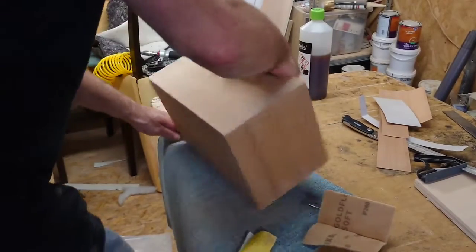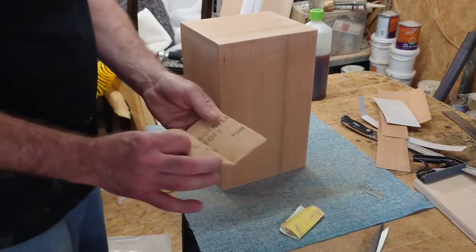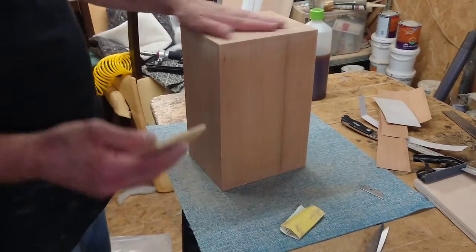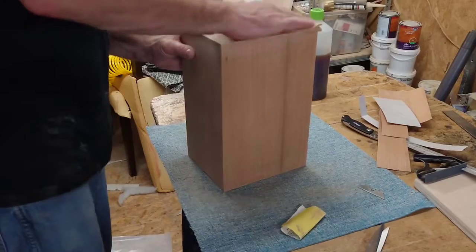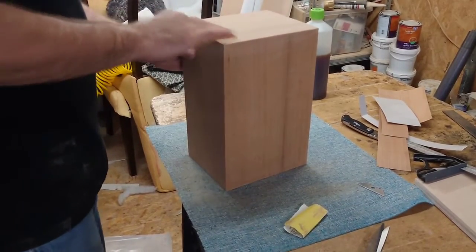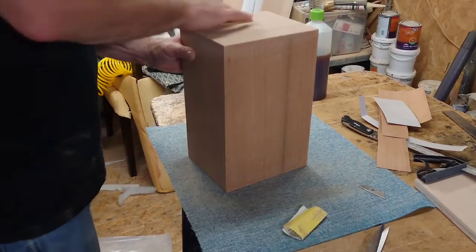So all the veneer's done. All we're going to be doing now is giving it a light sand back by hand with some 240. This veneer is quite smooth, so we can go in circles to start with, just to give it a nice feel, and then we're going to start putting some polish on the surface of it. Just some preliminary coats.